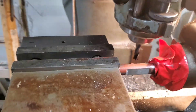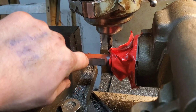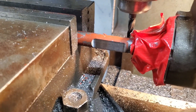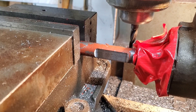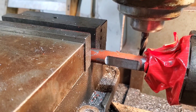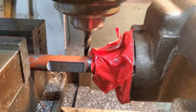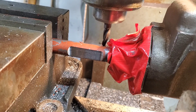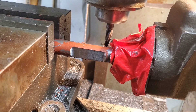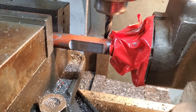I got the front side done, and then off camera I did the back side and finished the front side. The back side is a lot tougher because you can't see it. So if you ever have to do something like this, do the side you can see first — usually that's a good bet. Now I have to cut this off and fit it onto the shaft, or just fit the shaft onto the universal. I found a set of snap gauges and checked the universal — it's checking at 612 thousandths for the diameter, or the width of the flat that this is contacting. Doing the math, it should come out to 540 if I take 105 off both sides. It must just be some clearance built into it — it seems like a lot to me, or maybe the snap gauges are junk because they might say Harbor Freight on them.